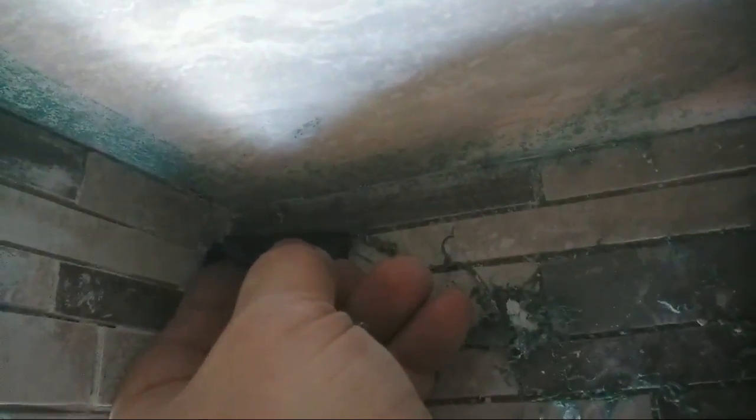Now I'm going to come along the bottom here. I'm just going to cut here in this corner from the bottom flat, come across and cut that loose. I'm coming across this bottom and cutting straight off to cut anything that may be still attached down in this groove here. So I'm cutting it loose below that corner so that the grout will cover it. If there's anything left, it won't be visible.